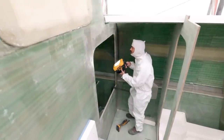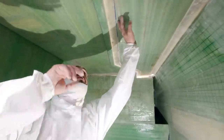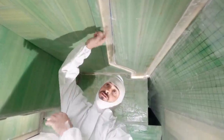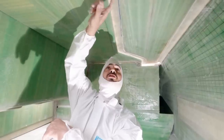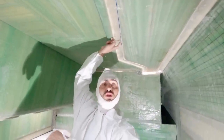See where I mapped out the overhang. So right above us is where the two pieces come together. You can see the core on either side and then the flange. And this is the underside bottom flange that's actually attached to the cockpit seat itself. But you can see it overlaps right now and is touching against the core. The core through this section is about an inch thick, so 25 millimeters. What I have to do is trim that down, which should be roughly about this blue line here. Cut that down and then it should drop hopefully into place.